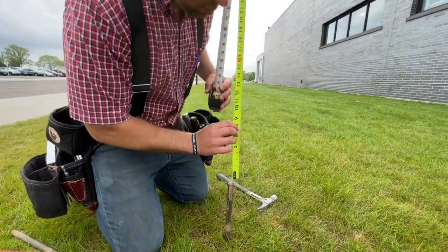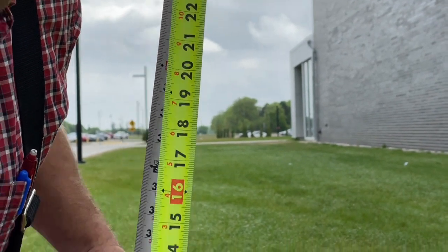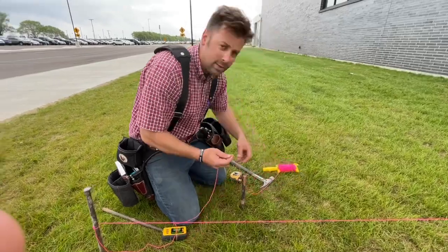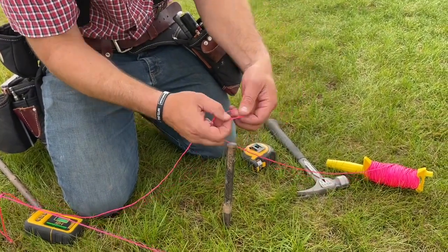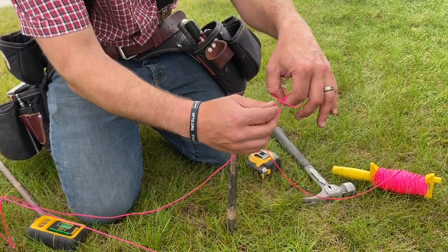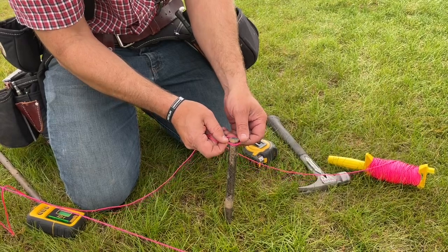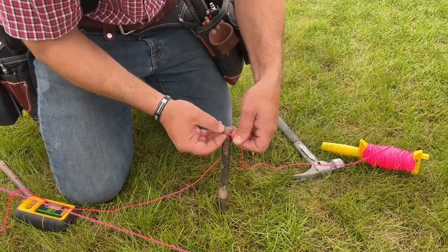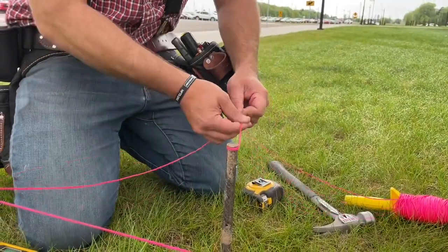Check it again — I'm at 20 and a quarter, 20 and five-sixteenths. That's good. Now, take a loose amount of line. The first knot we're going to tie is a lark's head: make a loop, put your fingers around, and the lark's head goes around the top of the stake. Render this down — render the lark's head to the back and just under the mushroom head so that it pulls tight and in line with the stake, just under that mushroom head to be entirely correct.